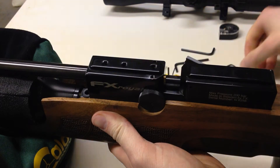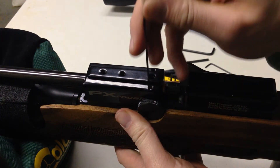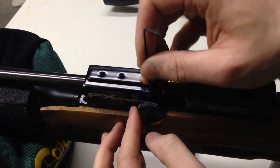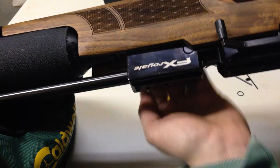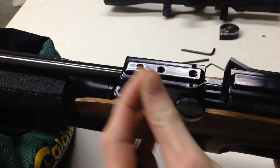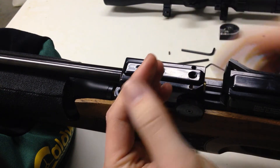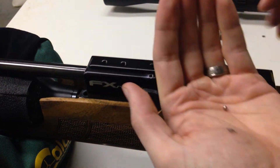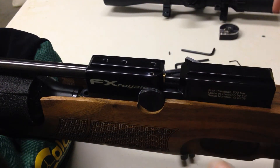It's not quite coming out, so sometimes you've got to poke an Allen wrench in there to get it loosened up. Wiggle it around in there to free up the spring and the ball bearing, so just be very careful because it's easy to lose. I got mine out of there now. Here's the spring — set that aside, you've got to be very careful not to lose it. And the ball bearing just rolled out as well.